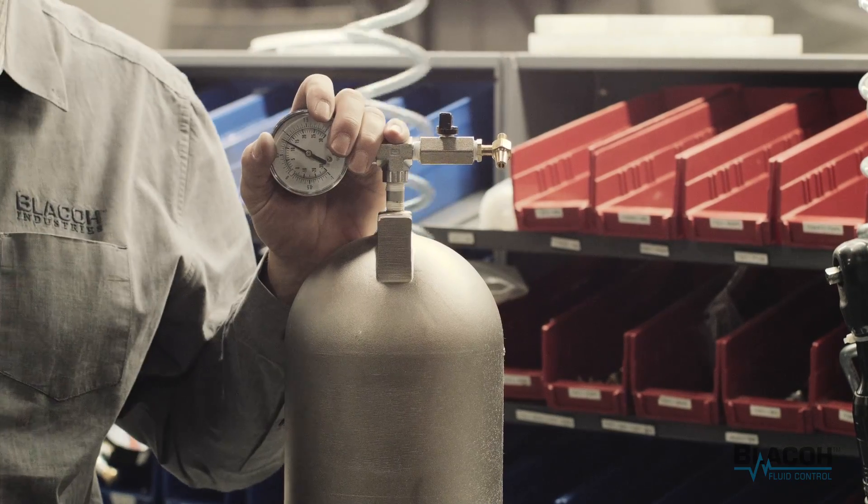There you go. You've got 50% of your inlet pressure, and you can adjust it accordingly. That will then allow a little shock absorber on the inlet side of your pump so that every time the balls close or seat on the inlet side of your pump, it will create that cushion for the pulsation — the inlet shock or surge on the inlet of your pump — and will take those inlet pressure shocks out of your system.